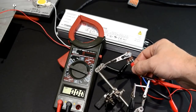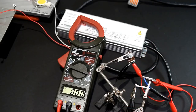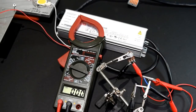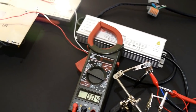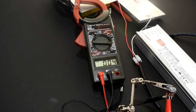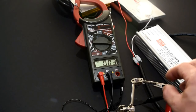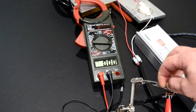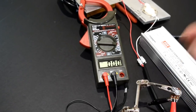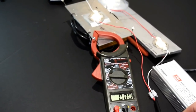The first method is a simple potentiometer. If you have one driver, you'll need a 100k potentiometer. Connect the positive or blue wire to the center pin and the black or ground wire to the left pin, leaving the far right pin open. With the driver off you have zero voltage; as it fires up, with the dimmer about halfway you're letting about half of the ten volts through, so the COBs run at roughly 40 to 50 percent strength. As you turn it down from halfway to 10 percent, the COBs dim. The more voltage you send to ground through the potentiometer, the dimmer the LEDs get. With leads wide open you get 100% — sometimes even 104 or 105 percent of the driver.